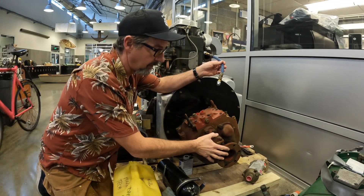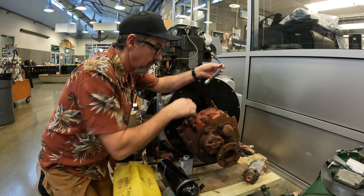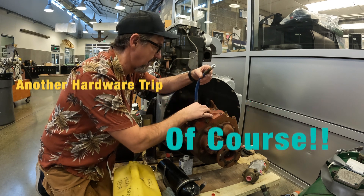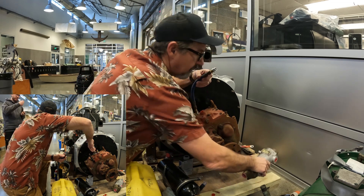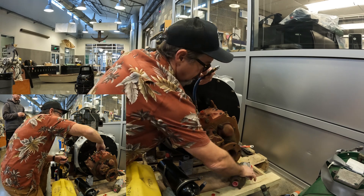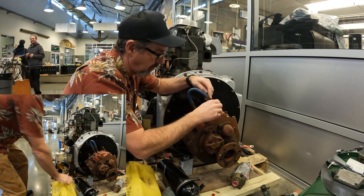We're going to get this engine started, but before we run it we need to get some oil in the gearbox — we don't want to run it dry. I think it's a brand new gear, a little rusty, but I went and got a little bypass hose we had in the shop and a couple of adapters. We're going to pop this in temporarily. Ultimately we've got a new gear cooler that will get mounted up here with sea water installed properly, but for now we'll pop in this little bypass hose so we can get this thing cranked up.